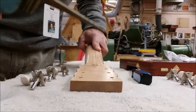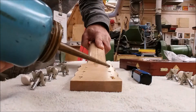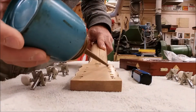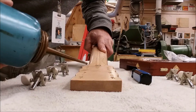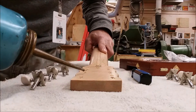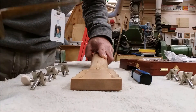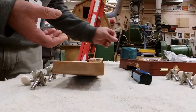The first thing I like to do is put a little bit of oil in each hole. That's going to prevent the screw from breaking, because this is hard maple and sometimes I feel the maple is a lot harder than the screw. So I got oil in every hole — just a little bit.